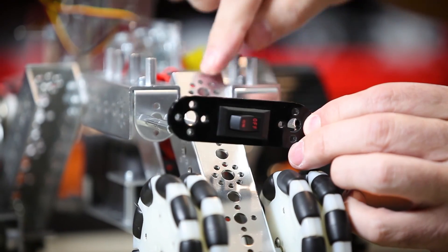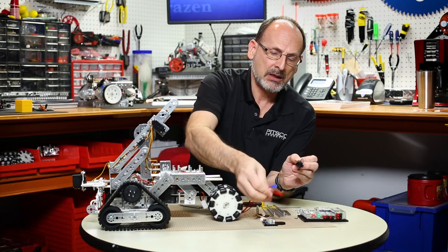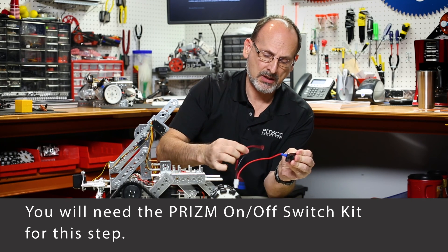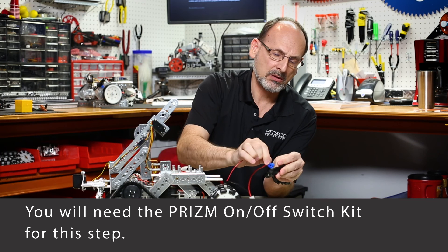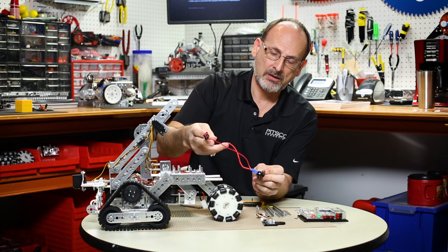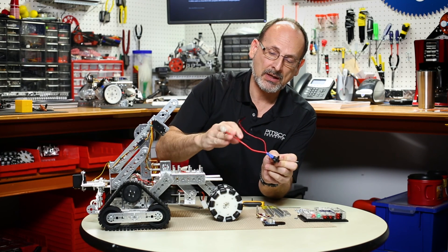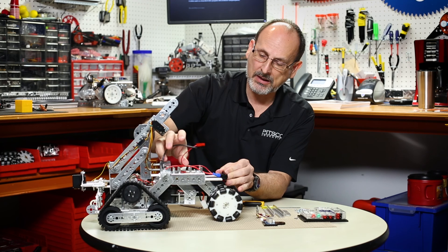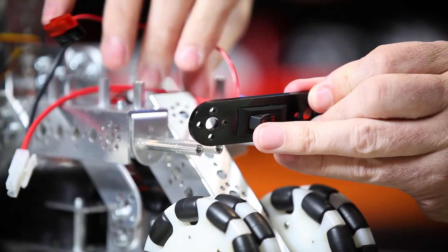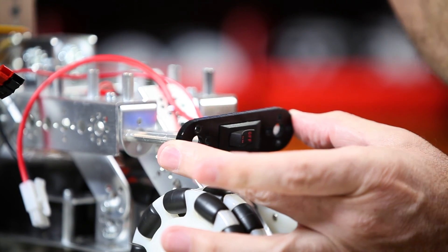When I use my wiring, I can route it up through here, so I'm going to put my wiring on first. I'm going to interrupt the red side of my triangle with the switch, interrupting the power side. You can see I've got a triangle with my wires — this side goes into the Prism controller, this side goes into my battery. I'll route those wires up along there and mount the switch with the button head cap screws.